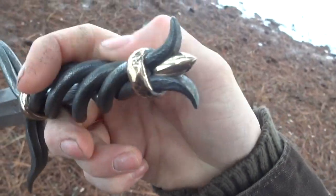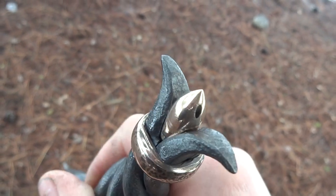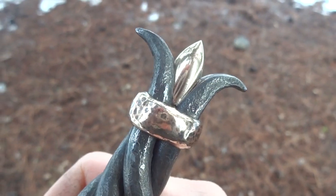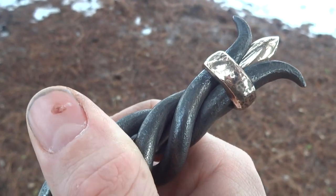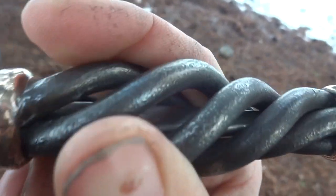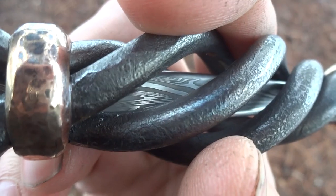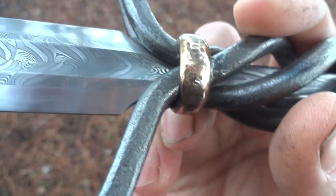On the back we have a bullet-shaped bronze finial nut that I turned, which sits down on a shoulder and the end of the tang screws into it. It forms a fleur de lis motif on the end of the knife by way of a pommel. It screws down and screws off — this is a takedown. Through the spiral of the handle you can see the etched tang of the blade with an elongated two-bar Merovingian pattern continuing from the core of the blade.